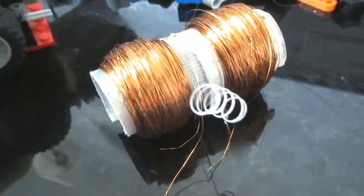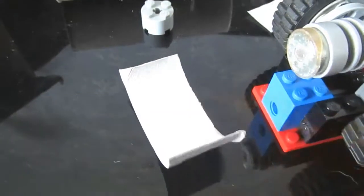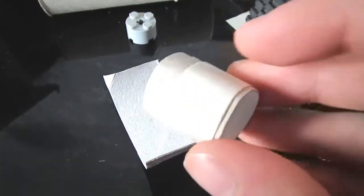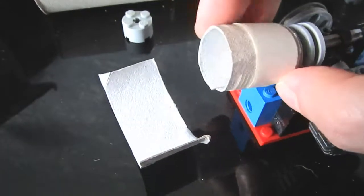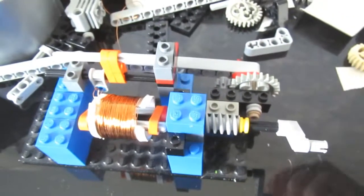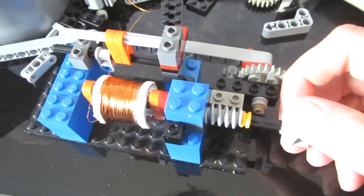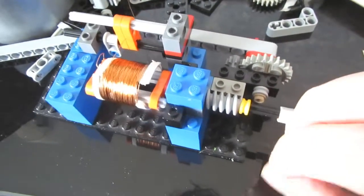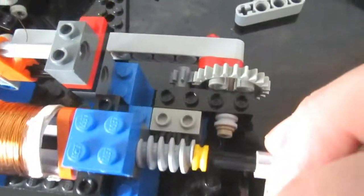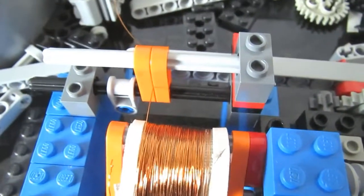So I'll need to make two new coils from this old coil. Just as with the big solenoid engine I'll be using carpet strips again. Here's one of the bases I already made — test fitting it — yep, perfect fit. I really don't feel like doing this all by hand again so I built a little automatic coil winder. It has a little crank which turns the coil and a crankshaft construction which moves the wire back and forth. Pretty neat.